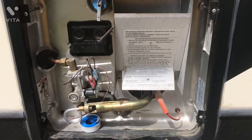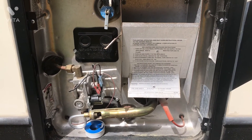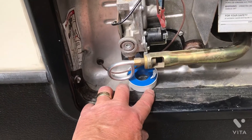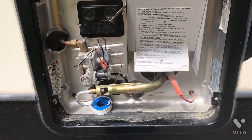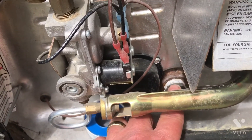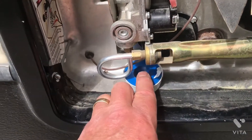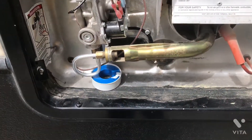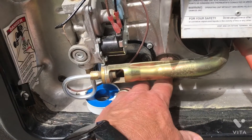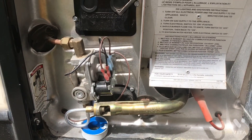By the inside of what this water heater looks like — this unit is eight years old and I've kept it very clean. You'll notice a small roll of Teflon tape; I leave it in there so I've always got it. When I pull the anode rod out and put a new anode in, I always wrap the anode threads with fresh tape. There are two reasons I leave the tape here: number one, so I can find it when I need it, and number two, if I'm out on the road and start getting a water leak, I can pull the anode out, re-tape it, and hopefully solve the leak issue.